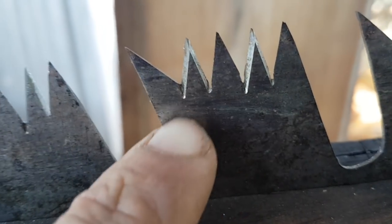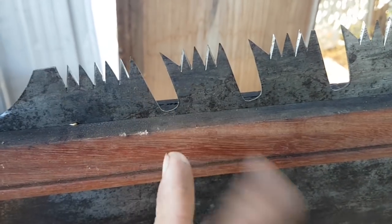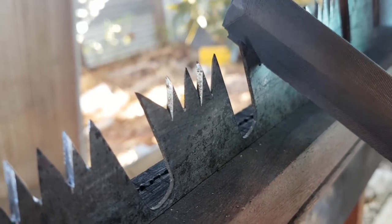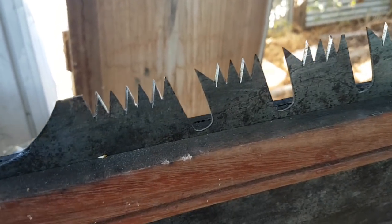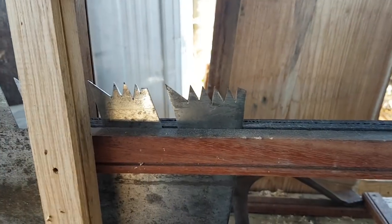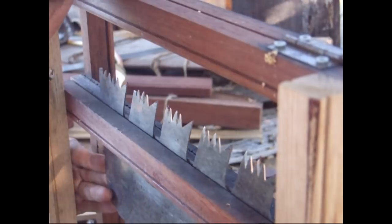What I'm noticing is that these tooth grinds are coming in at an angle, so I can't sharpen like this — I've really got to sharpen like that. Which means a modification I might need to make to this saw vice is chamfering this edge, so I can drop the saw down to an angle while still having the tooth close to the vice. To get that angle I've got to come down to here, which means the saw tooth is all the way up there, a bit unsupported, and I think I'm getting a bit of vibration. The weight of that saw is all out there out of the clamp, yet it's still holding it fabulously — I'm pleased with that, it's working well.